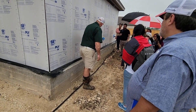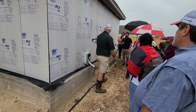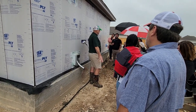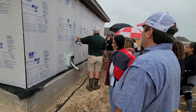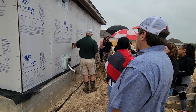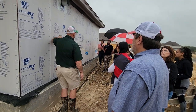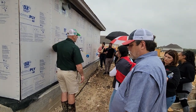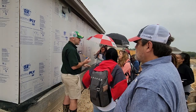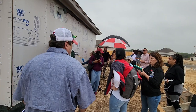I know I've got my main power servicing it, so that's going to be my big 220 power running in there. Today's code also says we have to have a 110 outlet by this mechanical equipment, so I know our HVAC is there. We've got this thermal ply — if you feel it, feel how it has kind of a waxy feeling to it. That's your moisture barrier or your vapor barrier — that's the thing that won't let water through the other side because this paper is permeated with wax.